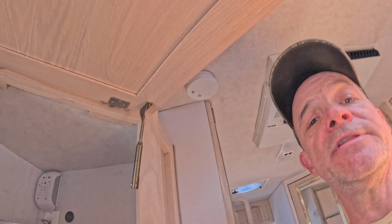Okay, so that's one way to test to make sure that your panels are actually doing something when it looks like they're actually dead or whatever, right? So remember, if your batteries are not depleted or using power, the solar controller is not going to allow that water to trickle into the battery. Okay, it needs to have somewhere to go, and if you're not pulling anything out, then it's not going to put anything in once it's full, and that's all that it knows.